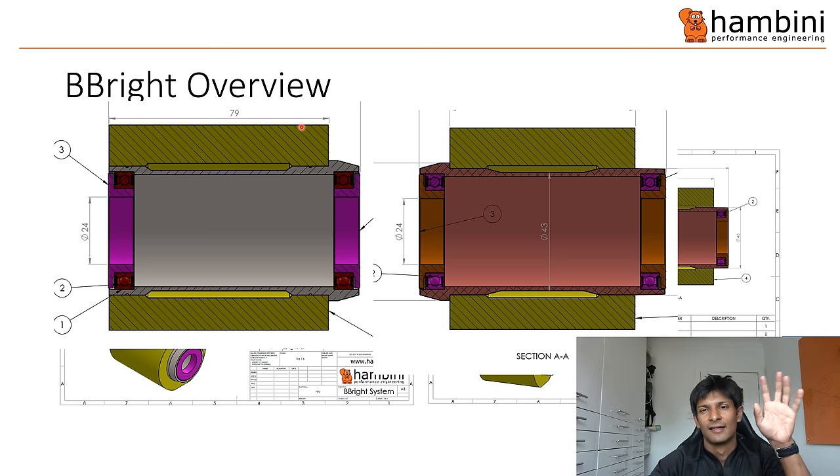The bullet just basically acts like a guide. The reason for needing this is because on B-Bright the non-drive side is completely flush, so there's no taper like there is on PF30 or even BB386 EVO, both of which have a taper that alleviates the stress raisers. The bullet has a slight taper on the end. This is the drawing for it — it's got my tolerances on there. We just need to use that as a guide.